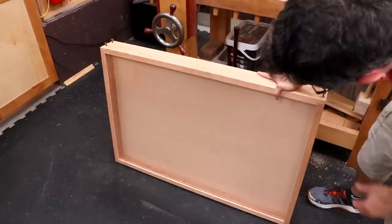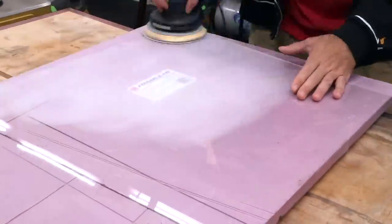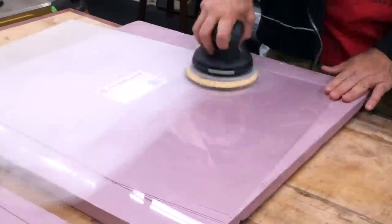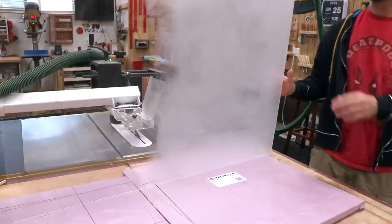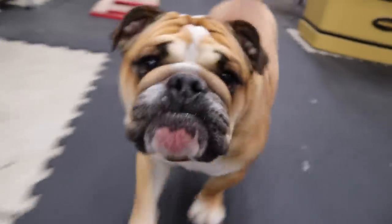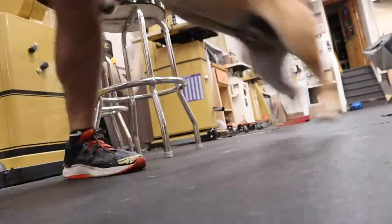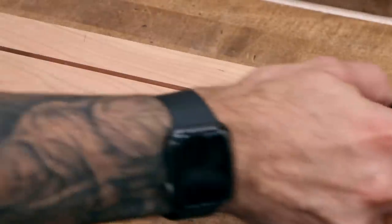Because the lights are so close to the poster, there's a good chance we're going to have some hot spots of light. To minimize that, I'm sanding the back piece of plexiglass on both faces with 80 grit. This should help scatter the light and act as a diffuser — it actually makes a pretty big difference. On the inside of the frame, I'm going to put a heavy chamfer on the inside edge of both grooves. This should help the plywood and plexiglass panels find their home during final installation. Probably should have done this before the glue-up, but yolo!